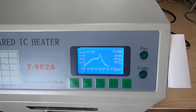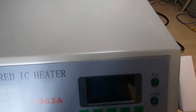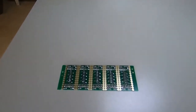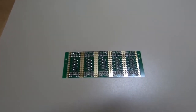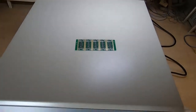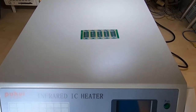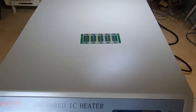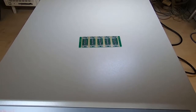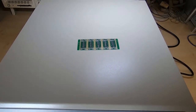We're cold enough now. I'll switch it off and we'll have a look to see what the results are. I'll take the board out, take a photograph, and we'll have a closer look. As you can see the board is successfully reflowed. It's a five-minute process; the most time-consuming part is placing the components by hand. In the next video I'll show you how to set up the pick and place machine to make this same board, which is obviously much quicker and also allows us to make them in full-size pallets rather than just single strips as I've done here.